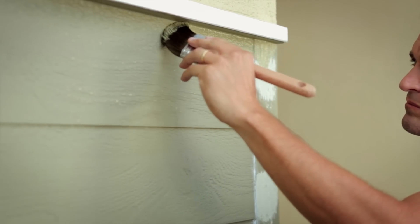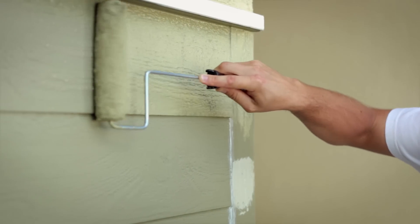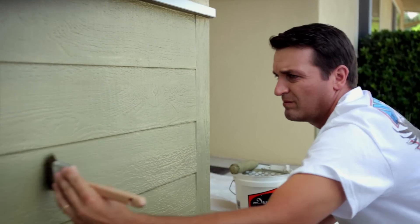The approach for painting the siding is to start on one side of the wall, paint the trim, then begin painting to the other side. Today's water-based paints dry quickly, so use a paint roller to apply paint over a large area faster so you can keep a wet edge and brush out the paint for a smooth finish. Start by using a brush to cut in the trim and any areas below drip or decorative moldings, then use your roller to apply paint over a three to four foot section of siding. Once all the paint is applied, go back and feather out the paint using your brush to get a smooth finish. Work as quickly as possible, then move on to the next three to four foot section and repeat the process.